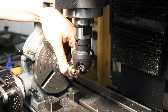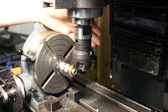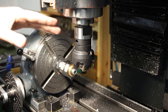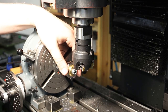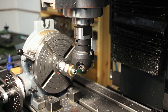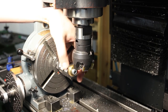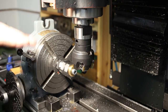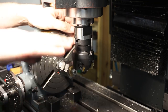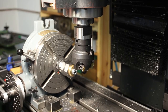So I roughed it all out. The part is still cool to the touch, slightly warmer than normal, but as usual with insert tooling when used at the right speed and feed, most of the heat goes into the chip, and the poor old chip gets all blue and bent. Now I'll take a measurement, adjust my final depth of cut, and cut all the flats all around with the final depth setting without changing my Z height. That way I get a very precise result.